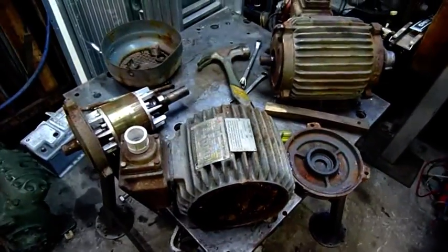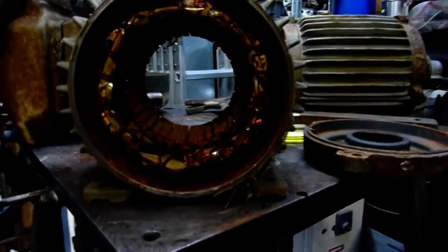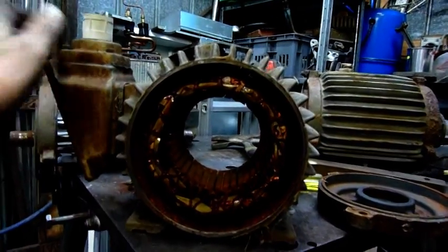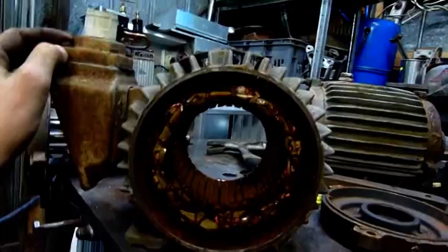The 1 horsepower is apart. The only part I'm salvaging is this end housing because the one on the 2 horsepower is badly rust damaged. I'm going to clean it up and repaint the whole thing. The stator on this one doesn't look too bad despite the water — I might clean it up and do the coke can test with the VFD. A couple of guys on YouTube run a motor stator with a VFD, hold a coke can on a wire inside it, and the can starts spinning. I might try a couple of ball bearings instead. I won't throw this one in the bin just yet.